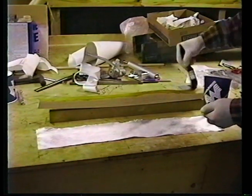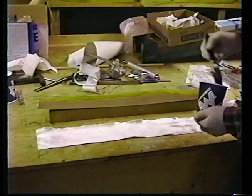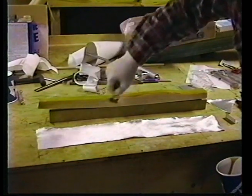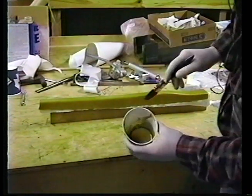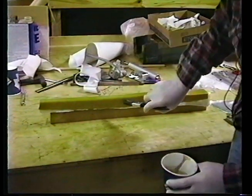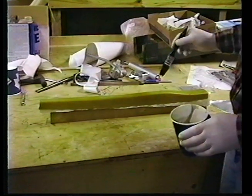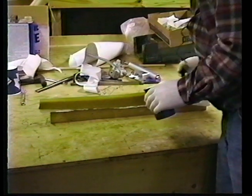And we're going to use some heat here to really do some fast wetting. Well, we just finished. This was two shots of resin, precisely. We have just a little bit left. It took us about 6-8 minutes to do, maximum. The heat gun helped a little bit. Not real high heat. Make sure there's no air in it.